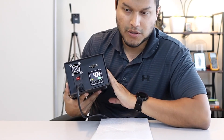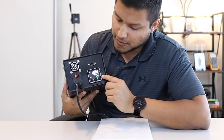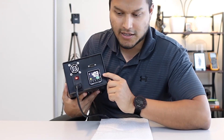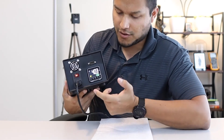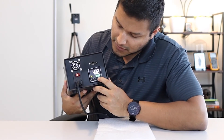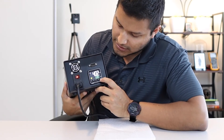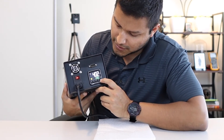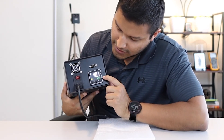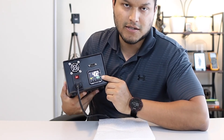The top value, the large white number, is the current temperature of the unit, and the set value is the target temperature. For example, if I set this to 45, the PV value will continue increasing until it hits the 45 threshold. You can increase or decrease as needed — to cool it down or raise the temperature. The PV will keep increasing until it hits the target.